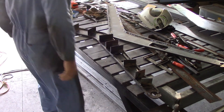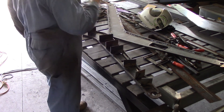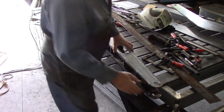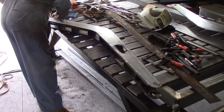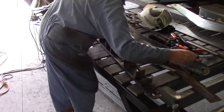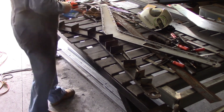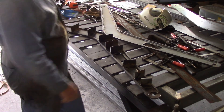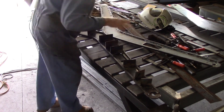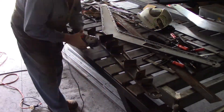One of the things I've got to do next is to knock the corner off these, because I've got weld bead along the corner of this top piece. So the first thing I'm going to do is put it on just fairly roughly where it's going to go — something like that's near enough. I'm just going to go along and mark on here where these sit, then transfer these marks to the top so I can see them once I lay it flat. I only need an approximate mark — I just need to get an idea of where I need to put the bevel and how much bevel I need. These are going to be a little bit more severe down here, not much at all there. I think I'd do better just doing stitch welding on the other side.